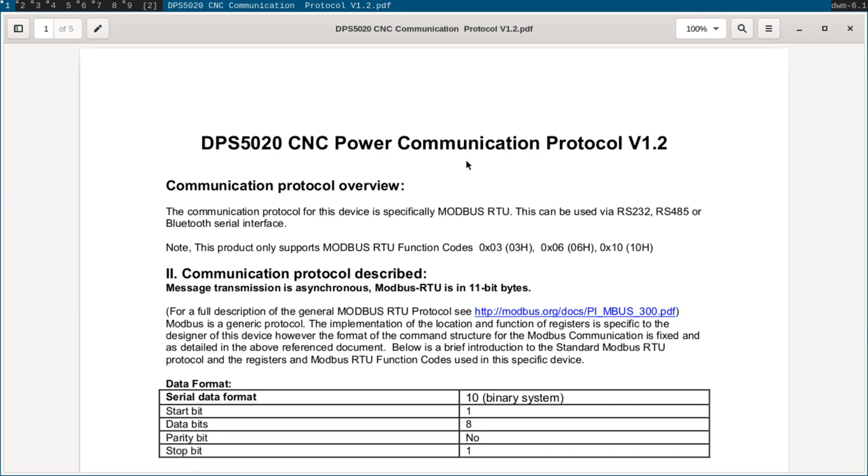The protocol is called Modbus, which is an industrial standard for industrial devices developed in the 70s that hasn't been updated since — one of those rusty crusty things. This is my first time using Modbus, but by reading the PDF and the Wikipedia article and messing around with some Python code I did come up with a good proof of concept. Before we get to the Python, I want to cover how this protocol works at the wire level — ones and zeros, the nitty-gritty — so when you see how much easier it gets with Python you'll appreciate it a lot more.